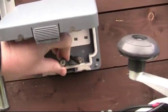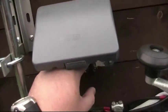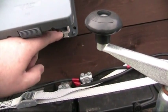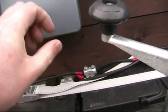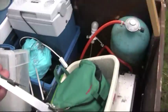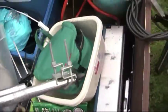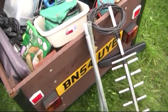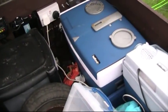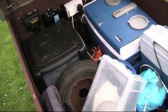This is a bit of an afterthought — I could do a better job really — but that's for the TV aerial booster. This pole here connects to a TV aerial which I can then plug straight into here. Then from the output of the booster, there's an extension lead which goes to the tent for the television or computer, whatever I'm going to use it on. That gives me a boosted signal if I need it. The aerial we use at the moment isn't a very good one — it sticks on the poles and gets about 10 to 15 feet high, which is good enough for what we've used so far. We don't really watch TV when you go camping — that's not the idea — but when you've got poor nights with rain and cold, it's nice to catch up with the soaps.